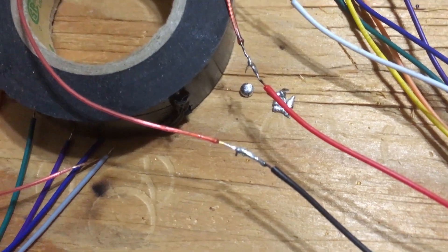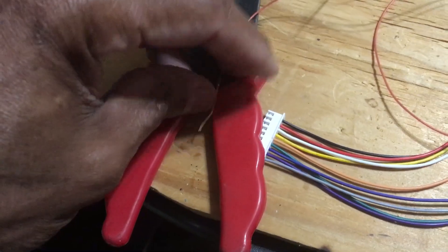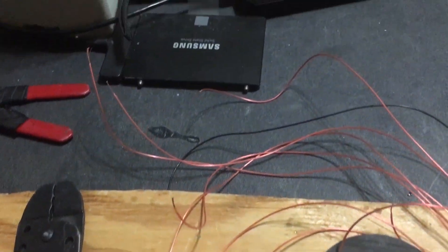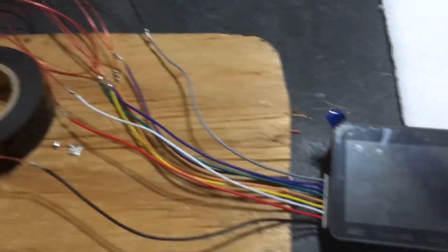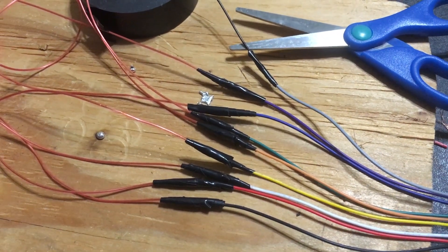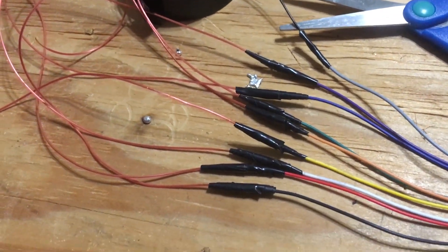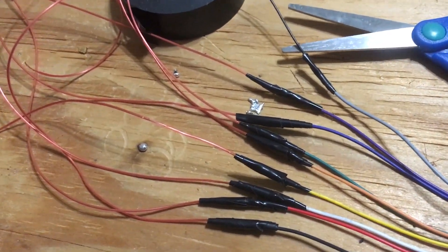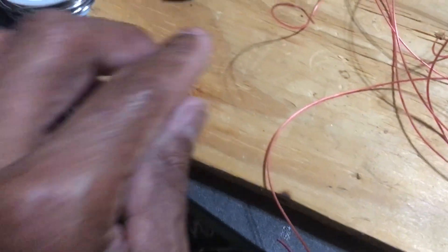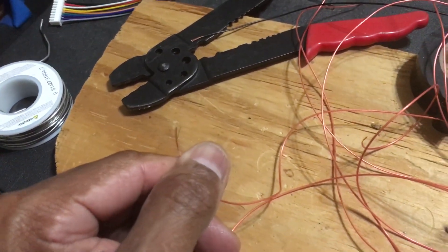Now I'm going to wrap it with electrical tape, and on all these ends I'm going to put the wire connector lugs on them, then hook it up to the battery to operate this. I got all the exposed ends connecting to the red wire from the colored wire in between wrapped up to protect each connection. I'm going to get ready to put the ring terminals on each end of these and then put them on the battery to show each cell's voltage differences and probably balance them.